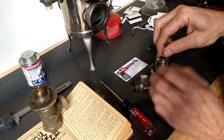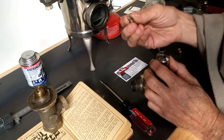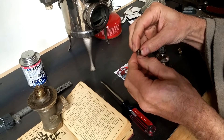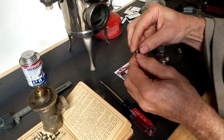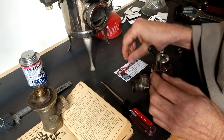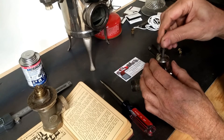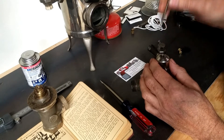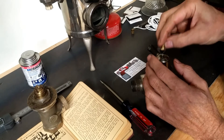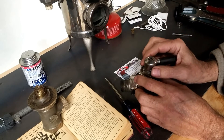First thing you do: remove this top screw. Do not lose this top screw — it is OEM. The threads are 30 threads to the inch, Number 10, 30 threads to the inch, which I don't think is easily obtainable. If you lose this screw, probably the best thing you'll be able to do is run a 10-32 tap, re-tap the hole, and then get a 10-32 national fine screw to go on top.